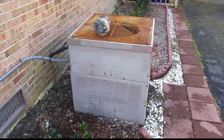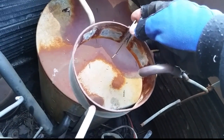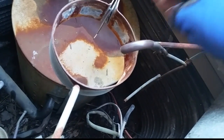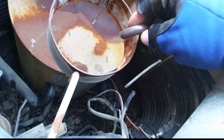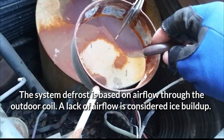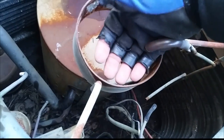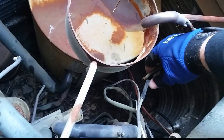We'll switch the motor. As you guys can see, this unit has the condenser fan motor facing up. We have our fan here in the middle, mounted three times — one, two, three. Right here we have a similar control to what we saw on the commercial eight-ton GE unit: a pressure switch to control defrost. We're going to make sure our motor rests about an eighth inch from that pressure switch.